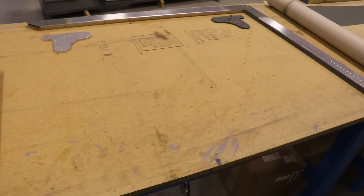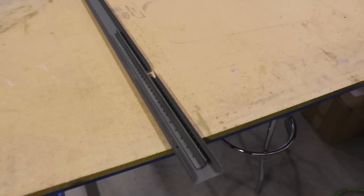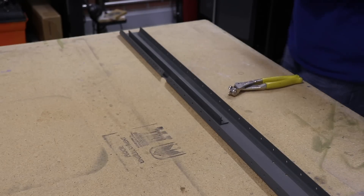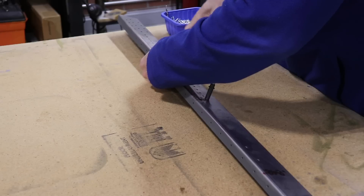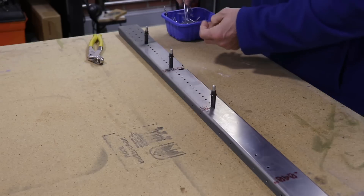The first thing I'm going to do — I have most of the parts laid out here — is get this L stiffener angle riveted on the inside. I've already done this side, now let's get this one riveted. One of the things I really like about the Zenith kits is how they're always improving them. These stiffeners on my cruiser did not have any holes drilled in them and I had to drill them all. Now they come already pre-drilled.